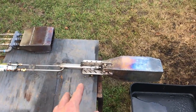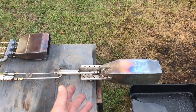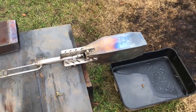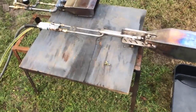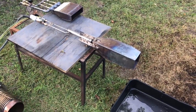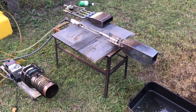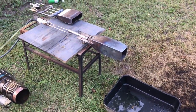However, the trick with natural gas is you may need a booster blower or booster compressor. Typical natural gas pressures are very low — you're not going to be able to hook this up to a 1 PSI natural gas line. You're going to need at least 30 PSI to provide 2 megawatts of fuel through an orifice this small. I'm going to do a propane test next just to show what it can do. It's going to be hard to get 2 megawatts out of a propane bottle — we're going to have to turn the bottle upside down and boil the propane in a vaporization coil.